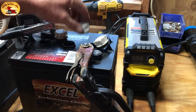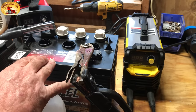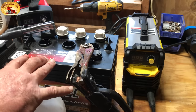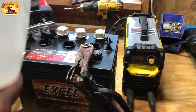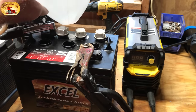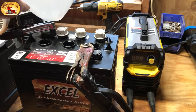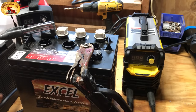It's real simple: take the caps off. With this system you only have to go five minutes, shut it off for ten, go five minutes, shut it off for ten — do it five times. We're going to top it off first with distilled water. You can use a funnel; fill it about half an inch from the top. Do this in a well-ventilated area. You want to see it bubbling really good for five minutes — that's when you start it.